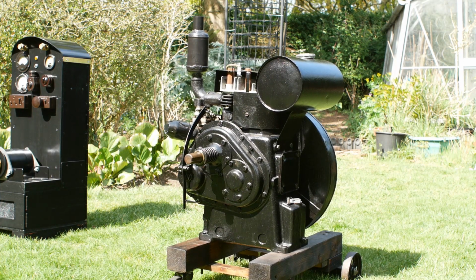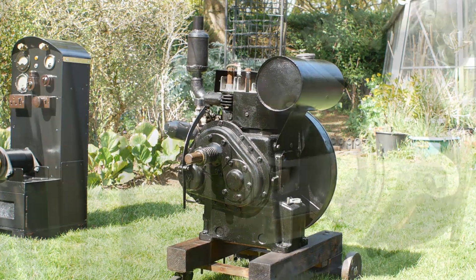You should only crank the handle a single time. If the engine doesn't start, repeat the procedure, turning the flywheel back against compression and then crank the engine again. If you crank the engine continuously, you're pretty likely to get a backfire because there'll be unburnt fuel vapour in the cylinder, and the spark on these engines occurs every revolution, not just on the combustion stroke.